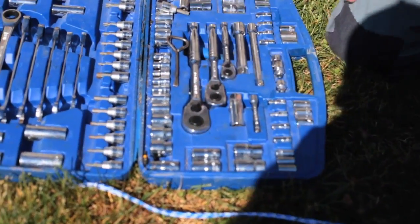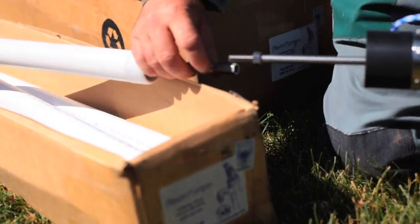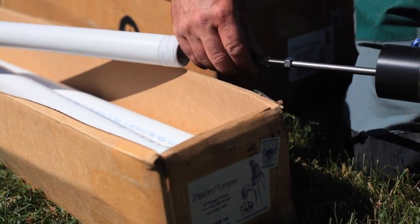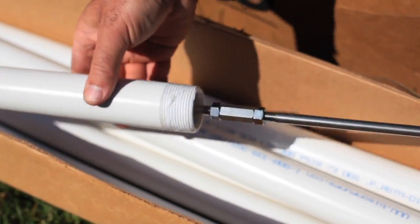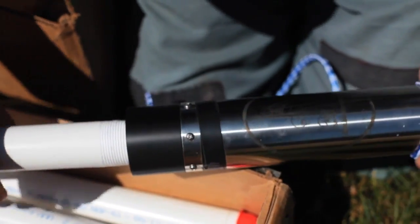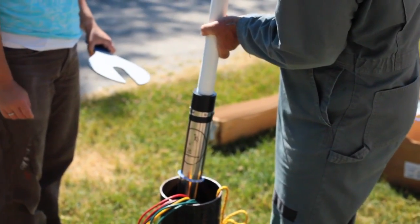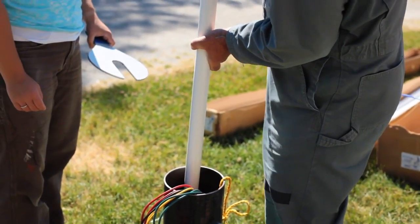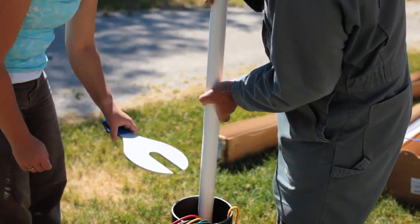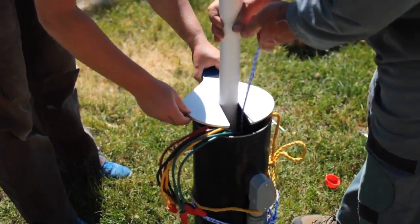The pipes used here are a food grade plastic type, and each one comes with a rod already installed in it. The rods are connected and then the plastic pipe is threaded in by hand. We start lowering the pumping cylinder and the first length of pipe. There's a rope attached to the pumping cylinder so if something goes wrong and it falls off the pipe, we haven't lost it.